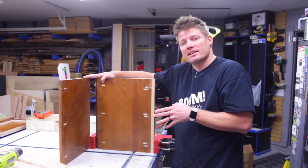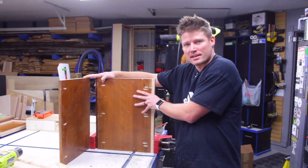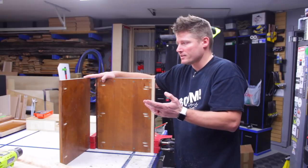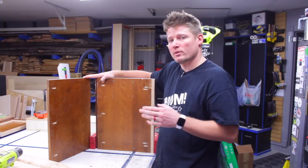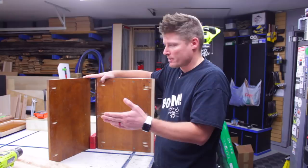All right, I'm going to start doing the drawer box cavity assembly. This is the right-hand panel with the faux frame and panel on the other side that'll be visible from the knee hole on the left. This is the back that's going to be attached to it. The back only has pocket screws on one side, which are going to be screwed into the leg assembly on the left in the very, very back.